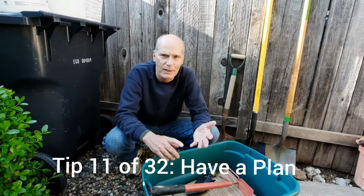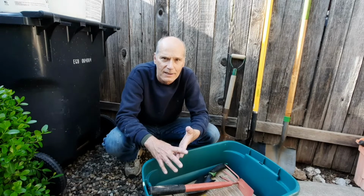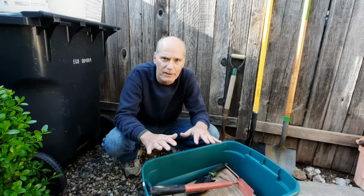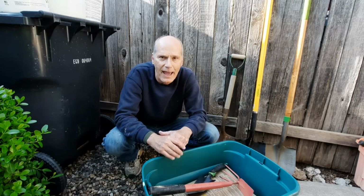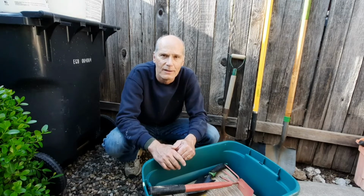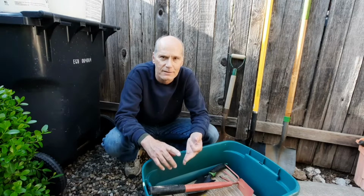We're going to measure, mix, pour, screed, bull float. It's kind of a small area, but we're going to pack down the aggregate to make sure that it's below the surface. Then we're going to wait 30 minutes, get the water to reabsorb. Then we're going to edge, joint, finish, and then broom.